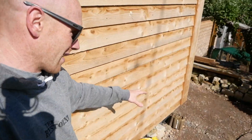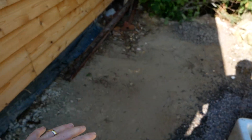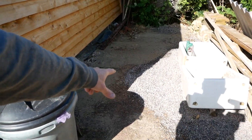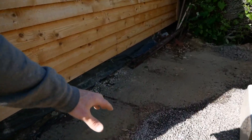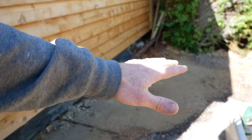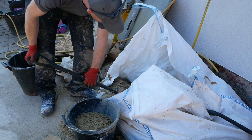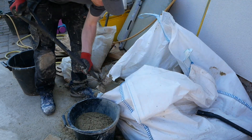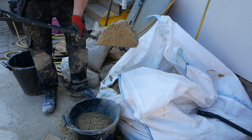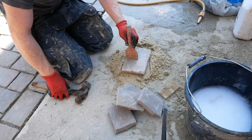When we go around the back here, I've cleared out this area and put in the Type 1. There's a bit of sand spread out there. All this has got a membrane under it anyway, but we're going to use this clean limestone - a normal 10 mil chip - which is a good way of giving a simple base around here for storing things like a cement mixer, maybe a little shed in the future. The necessary but rather dull prep work is done, and as you can see, I've made a start on the path. Will's the other side of the wall from my office, finishing off that mortar chipping out.